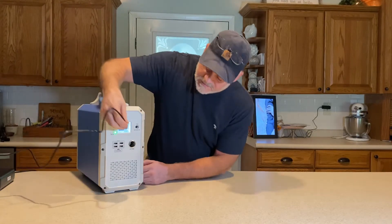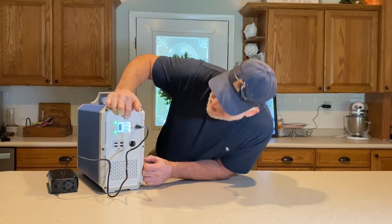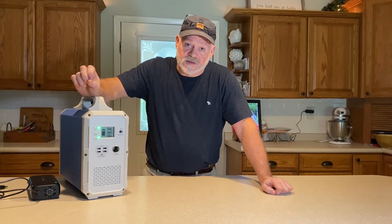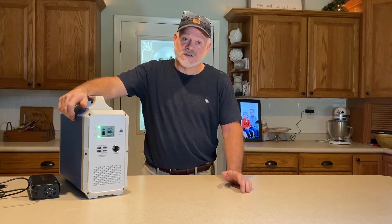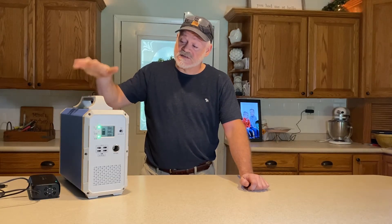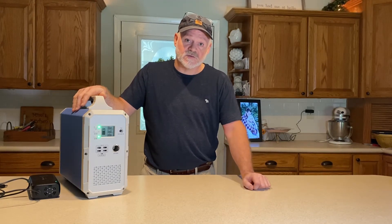What I've learned is that I have an AC-200P, an EB-70, AC-30, and this EB-150. The power brick that comes with it charges at 211 watts. Now, the EB-150 will take up to 500 watts of solar. Despite what you hear in a lot of chatter about the EB-150, you can get to 500 watts. The way to do it is to string 600 watts of solar panels — a series at 300 and another series at 300 — and bring them in. I know that sounds over the 60-volt rating, but I emailed Bluetti and their response says this unit can handle 68 volts going in. I've seen it tried by another individual on YouTube and it does work.